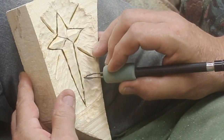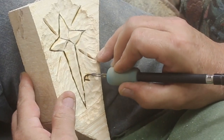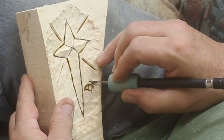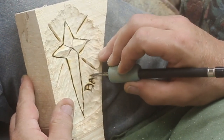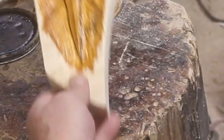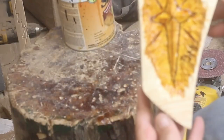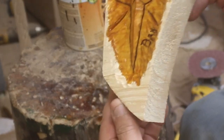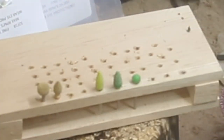These burrs are kind of unique — as they start to wear down they get different properties. The ruby burrs get a little bit smoother and start burnishing. That's about the end of the demonstration. Jordy, Just Carve Rob, and the guys in the links below — the carvers I follow — always sign your work. I like the shellac; that's an amber shellac, a quick one-over-the-world. I'd let this dry, steel wool it, maybe put another coat or two on, then put on Johnson paste wax.